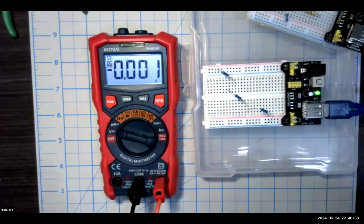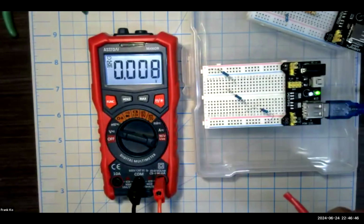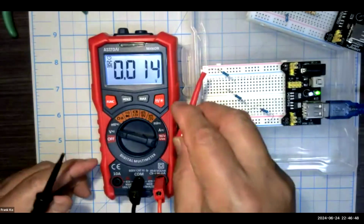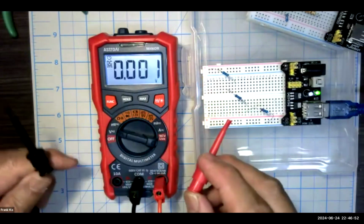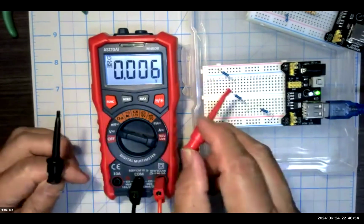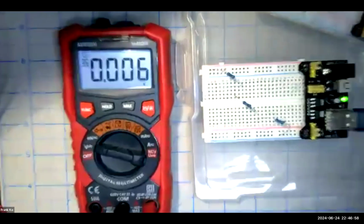All right. So we said earlier, we should have VR1 measuring 2.54 volts. So I'm going to measure the voltage across R1. Now, voltmeter connections are polarity specific. So the red probe has to be on the more positive side of your device.